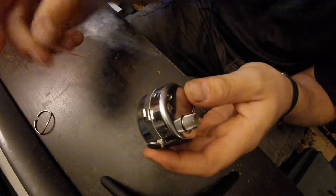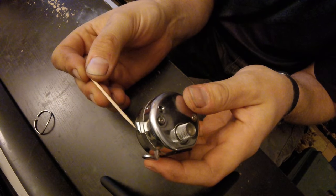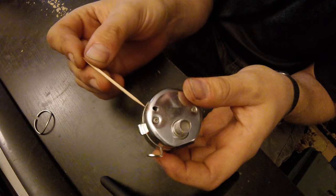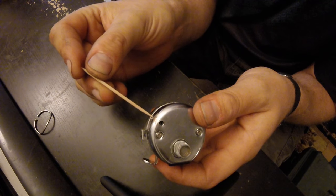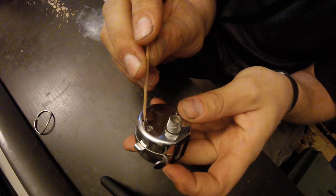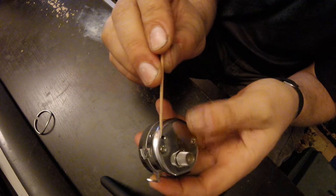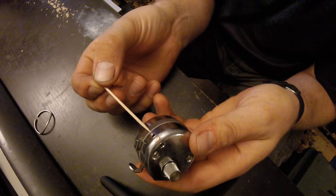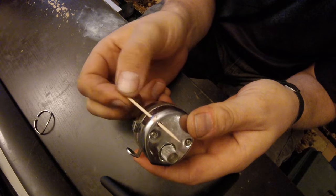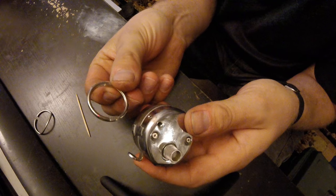I took a 3/32" drill bit. Here's your button and the plastic piece that held your pin before, and here's your screw. I drilled straight down here with the 3/32", then drilled straight through here perpendicular — one hole to the other. Then I took a 1/8" bit and ran it from one hole into the other to connect them and clear out all the burrs.